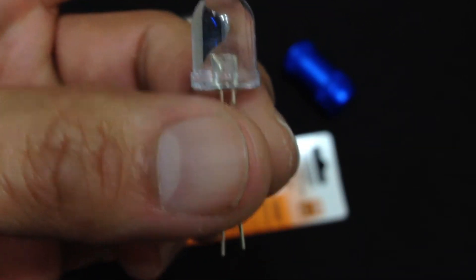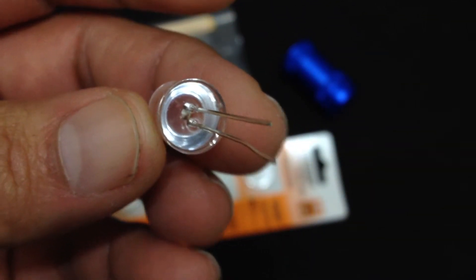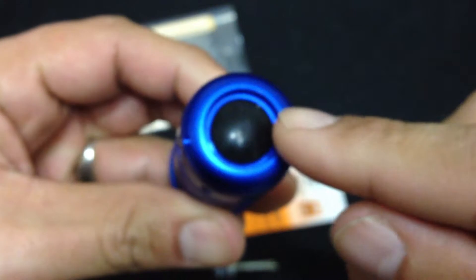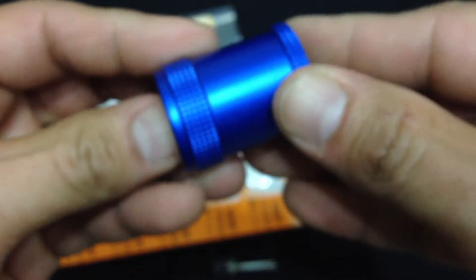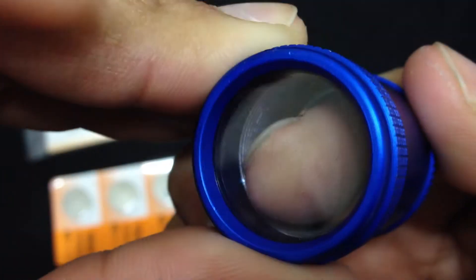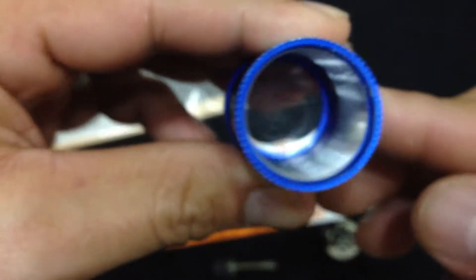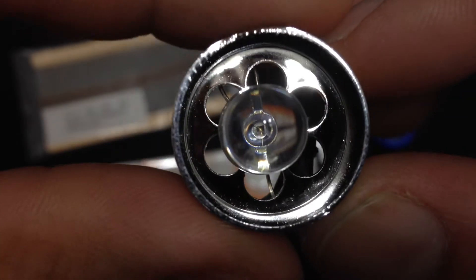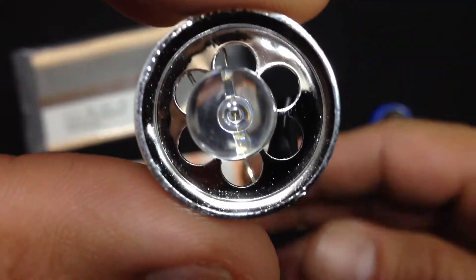They are single chip, water clear. This flashlight now uses only one button battery. I'm going to show you — it has the power on/off switch here. I'm going to take it apart and show you what I did. I just stretched the spring out so I can use one battery. This is bootleg, but it works. Here's the little plastic lens. This originally housed six regular LEDs — just a little molded assembly that held them together.